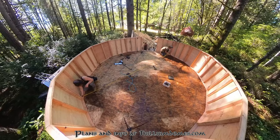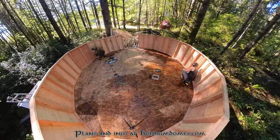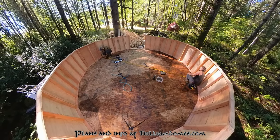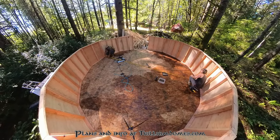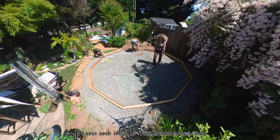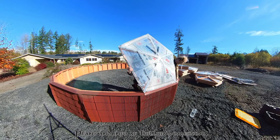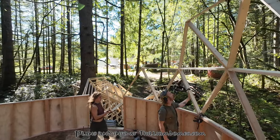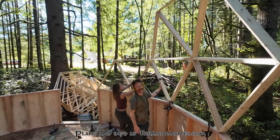Once you've made your way all the way around the dome base, you'll put a placeholder for the doorway and now you've got the whole structure. As you pull those measurements, you'll be tacking the base sections to your foundation, deck, or the earth. Once those measurements are correct on every corner, you know your pony walls or base sections are totally lined up where they need to be, and once you're happy with that, you can start stacking your panels.